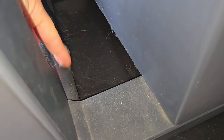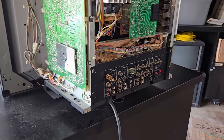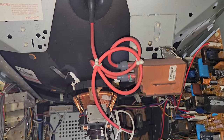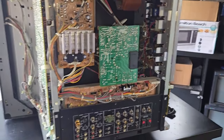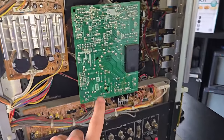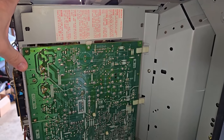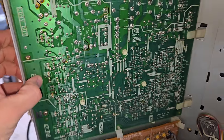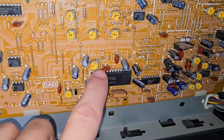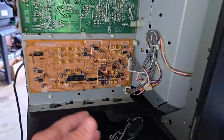Now that the shielding and back plate is off, let me show you around inside this 32-inch PVM. Looking down from the top, there's a lot of room in this one, which is good for working on it. You'll also notice a lot of circuit boards. We're not interested in most of them for this complaint — if we have a problem with vertical line collapse, maybe the vertical out circuit has an issue, or maybe it's down here in the vertical size area. Maybe a capacitor is out, or on a set this old, the potentiometers can go bad.